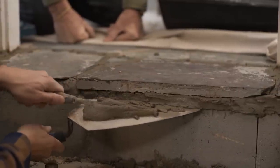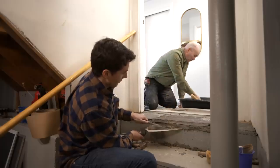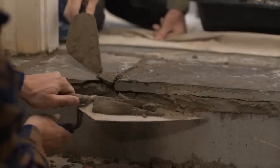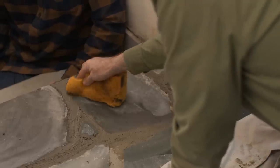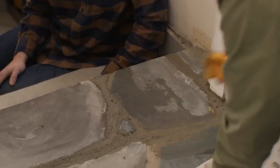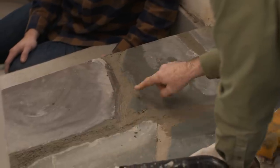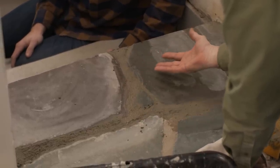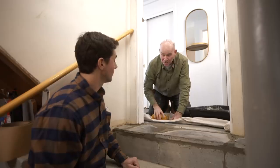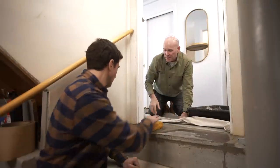You see the voids — all we want to make sure is we don't have any. Be mindful that the stone is still floating a bit. I'm going to use the sponge for a couple different things. I'm going to clean the edges of the stone, but most importantly, I'm going to rub this sponge over that joint. You see the sand that I'm picking up? That sand, we call it the aggregate. All that sand is going to be pulled up to the top and it's going to mimic the existing joint, and eventually everything ought to look the same. We'll have to do this a few times.